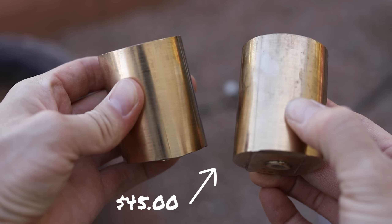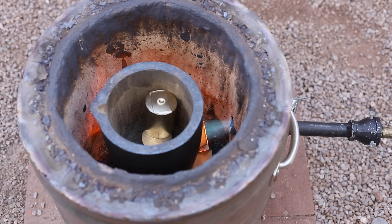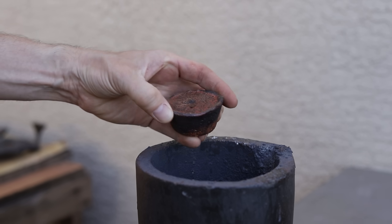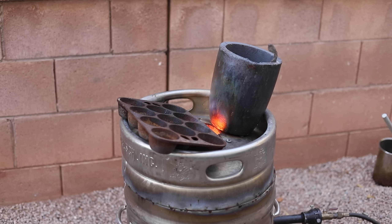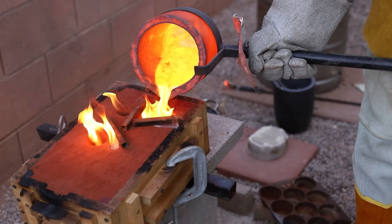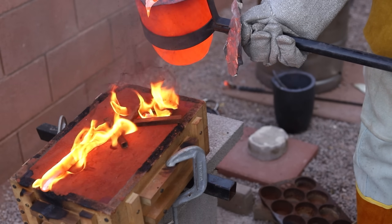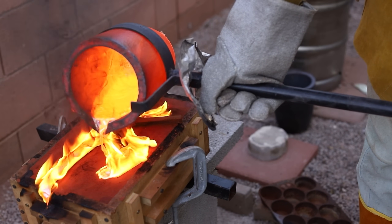This is the aluminum bronze that I bought. It's called C630 and it wasn't cheap, but hopefully it'll work really well. I'll make the tin bronze myself using 88% copper and 12% tin. It always amazes me that with metal casting you can take ugly materials like these and turn them into something really cool. I poured a little bit of the leftover metal onto the top of the molds in hopes that I could cut strips off of it and use it as a welding rod to fix any imperfections in the castings.